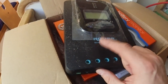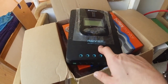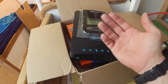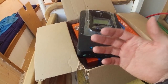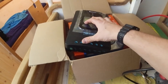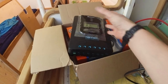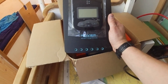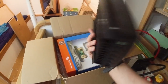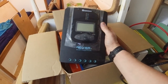It's a 40 amp MPPT charge controller. There are PWM charge controllers and MPPT charge controllers. The way MPPT works is any excess voltage brought in from the panels — solar panels are normally up to 17 volts — is converted into charging amps rather than into heat. So these are far better than PWM controllers. This one was about a hundred-something euro, and it is specced for lithium, so it can actually run lithium batteries too.